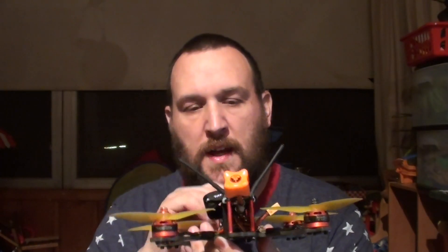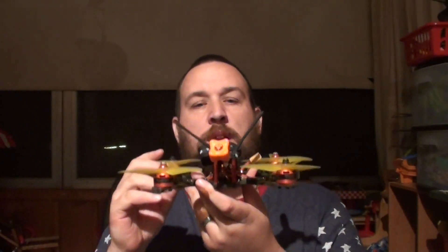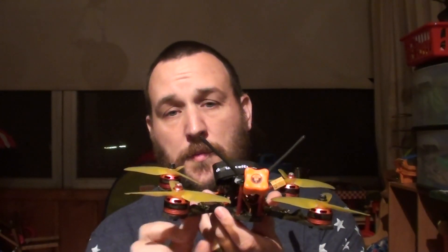These are diversity antennas. This means that whichever antenna is getting the best signal is the antenna the transceiver is going to use. And when you have them the way that Josh has them, he's got them coming in front of the frame, so if he's flying away from you, that arm is blocking some of the signal — he used that explanation for some of his reasoning. But I don't think it's going to really block it that much. I'm sorry, that was kind of a shot and I don't mean that — I apologize.